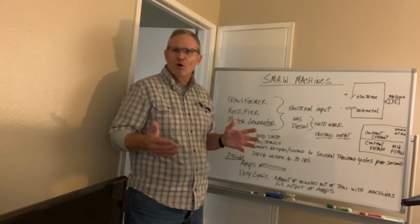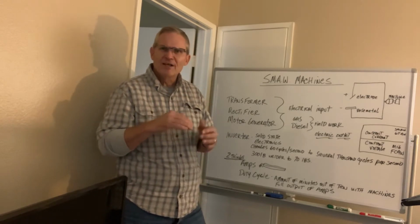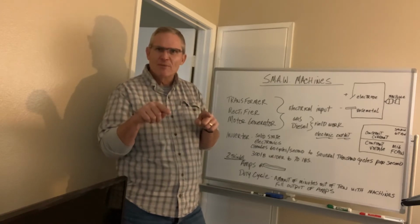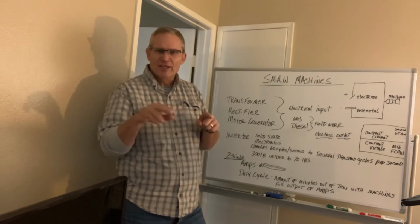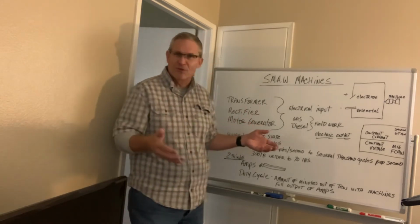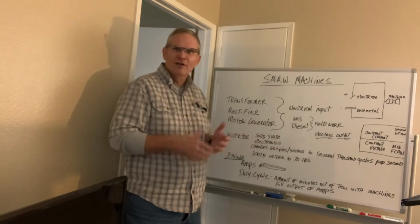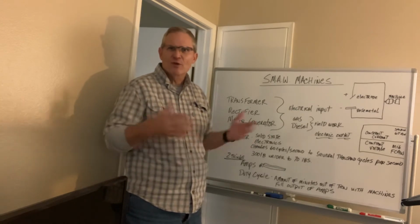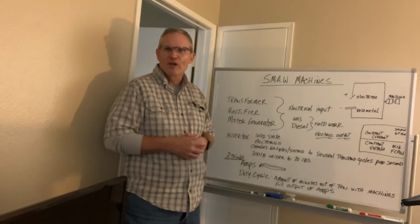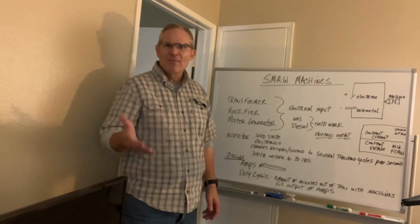But wherever you purchase the welding machine at, they'll have a chart where you can look at the chart and you can see, okay, if I run 125 amps, this is going to be my duty cycle. And when you look at the 70% range, well, normally out of 10 minutes, you're usually doing something for 3 minutes. Wire brushing, chipping the weld, looking at the weld, assembling something, such and so forth. So in essence, you've just purchased yourself a 100% welding machine where you can do as much welding as you want. Now, why am I mentioning that?